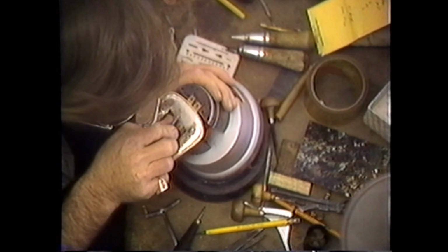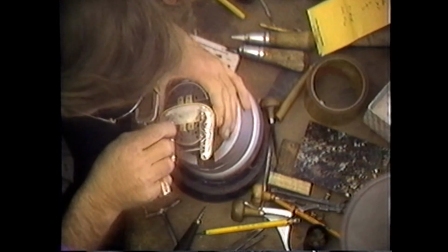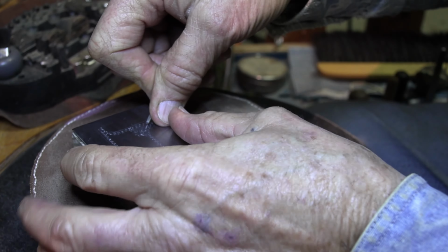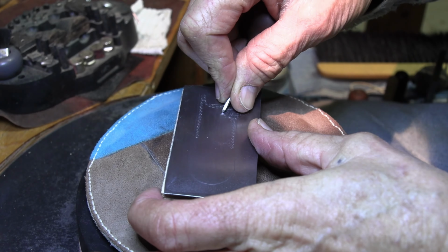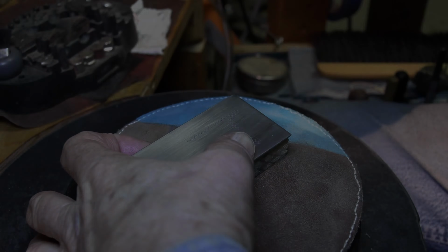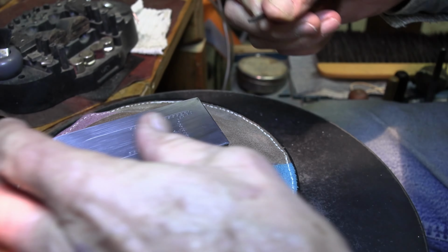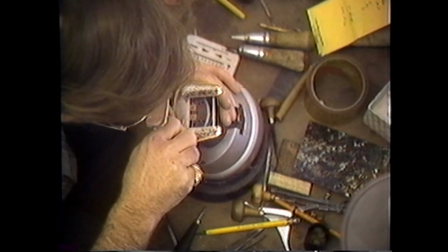The reason for this is for a right-handed engraver. In the beginning, gravers were pushed by hand to make the cut. While engraving with the pushed graver, the graver was placed at the start of the cut. The right thumb was placed down firmly upon the piece, if possible, not interfering with the layout. The left thumb was placed firmly against the right thumb to aid in preventing slipping. The cut would be made counterclockwise with the right thumb as a pivot. This pivot enabled the most natural way of the cut.